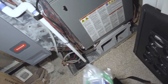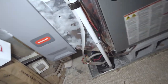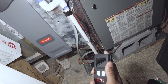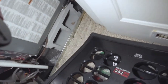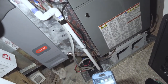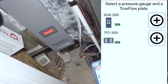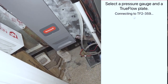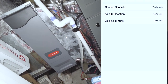Now we've got my static pressure probe. The cool thing about this is it's pretty much foolproof the way they set this up. We're going to turn on the manometer — hold down the power button for three to five seconds — then turn on the True Flow and grab the app. In the True Flow app, select 'system airflow' instead of pressure.